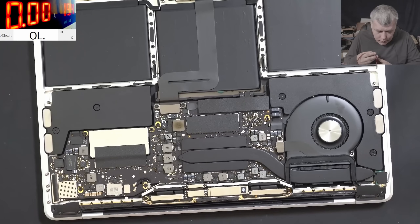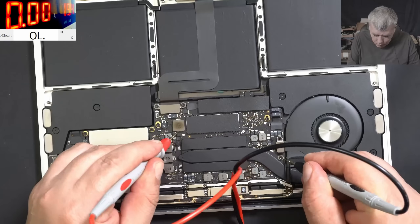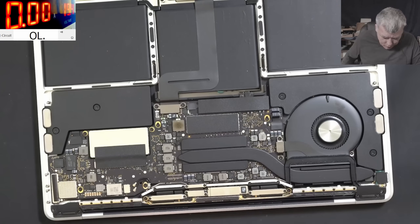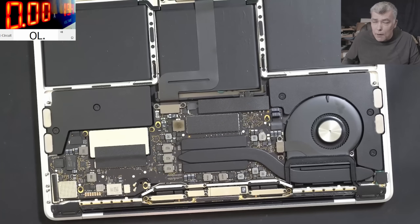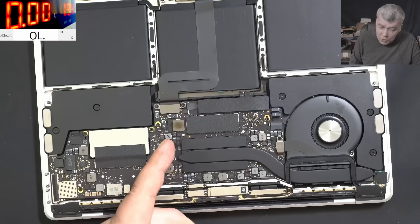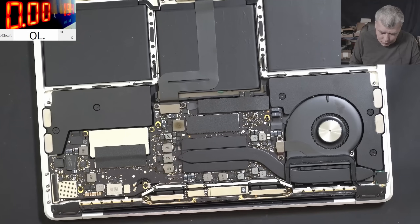The customer spotted the coil. I believe this is the charging coil. The coil is not shorted to ground — that's the normal color of the coil. Obviously it's not shorted to ground because it has a MOSFET on the front. And the MOSFET is good, because otherwise I would have a short even on the coil. So nothing wrong with the coil.